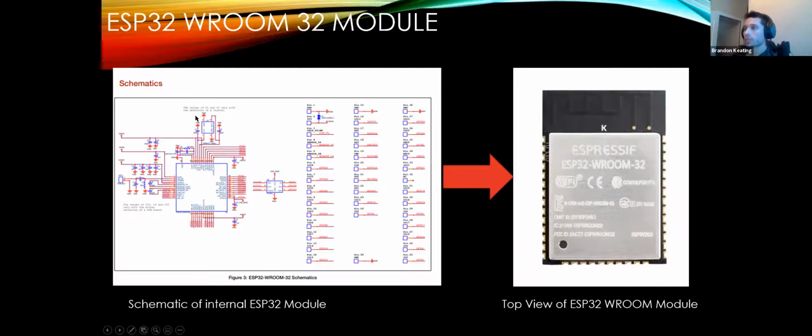A couple of things are going on here. All the way at the top, this U1 is the internal crystal that's going to work as the ESP's clock. You'll see a lot of these little symbols right here, which are just capacitors to ground. These are really just to protect the circuit in case of a power surge. If it got over current or over voltaged for a moment, these help eat some of that power and don't let it just dive into there.